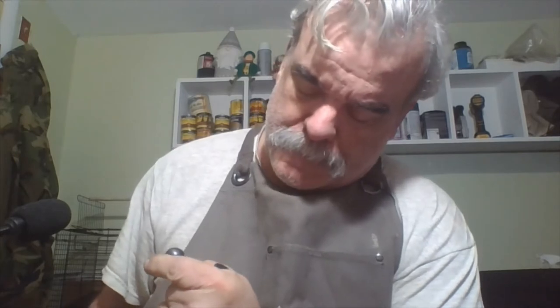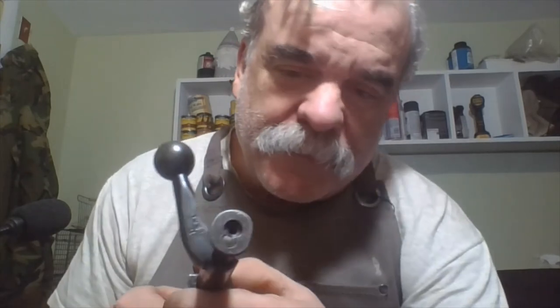Look on the back — you can see the firing pin coming in. On the firing pin on the back there you can see there's a little cutout; that cutout is for the locking screw. I'm not going to do it here because it's a trial-and-error thing, but there is a way to adjust the protrusion of your firing pin out of the bolt head. You put your bolt head on and measure how much it protrudes using calipers.